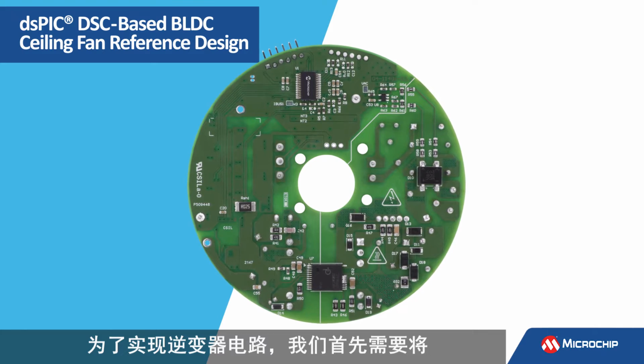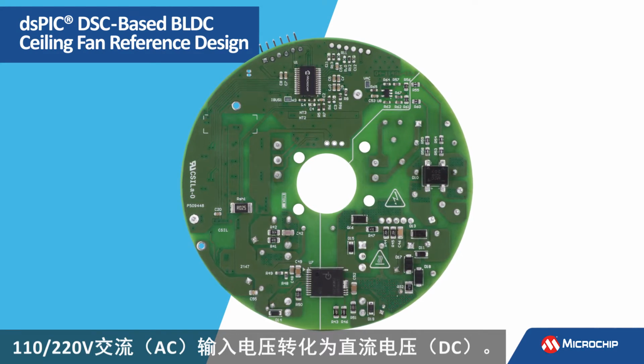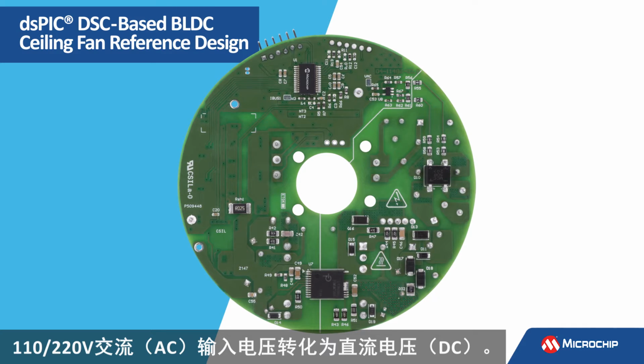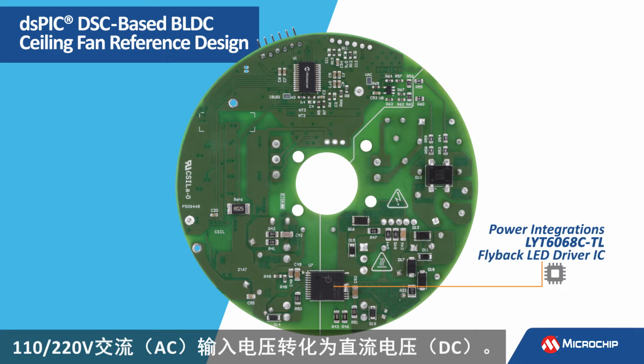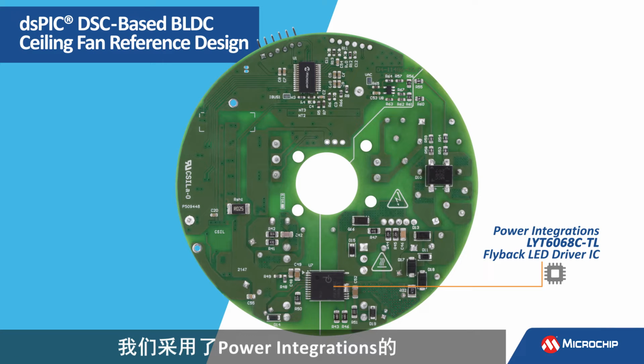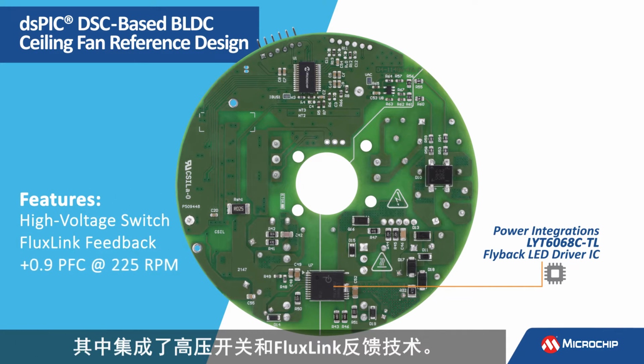To implement the inverter circuit, we first need to rectify the 110 or 220 alternating current, or AC, voltage input to direct current, or DC. We used a low-cost Power Integrations LYT6068C-TL flyback CVCC switcher LED driver IC with an integrated high-voltage switch and flux link feedback.